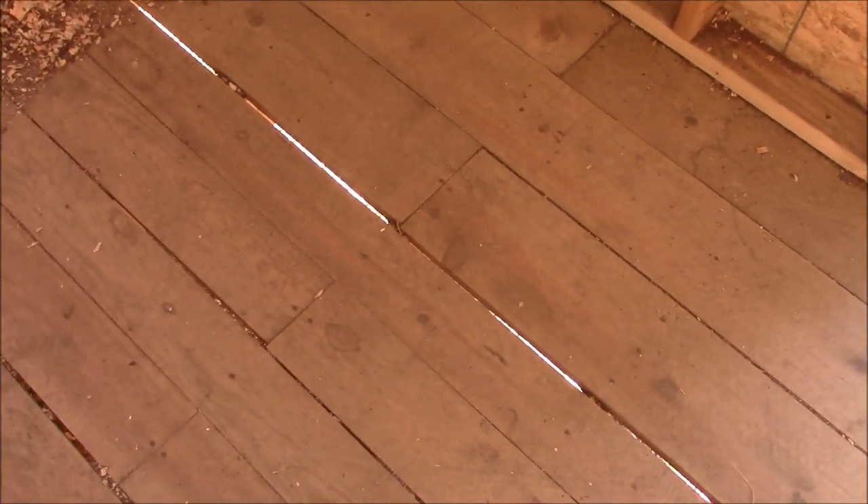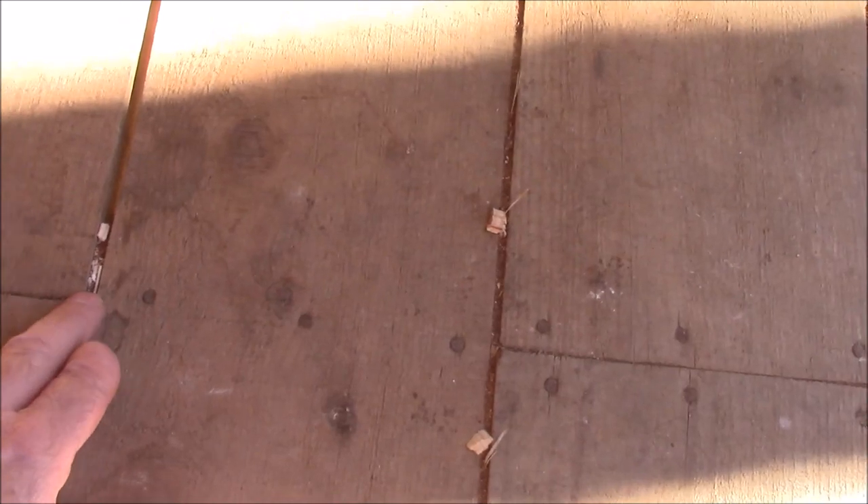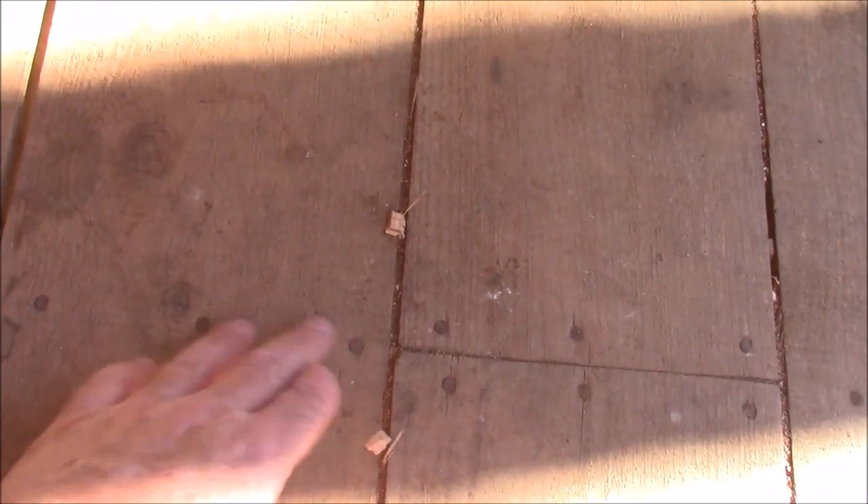I may come back and put some more nails in, but I've been using it — this floor has been out here about close to eight months now, so it's good and dry and it's serving the purpose. You can see there are some gaps between the boards. Part of that is from the boards not being perfectly straight when I put them down, so when I tried to butt them up against each other some didn't butt exactly. This is a really good example right here — I've got almost a quarter inch gap, maybe a little less.